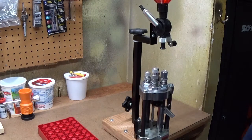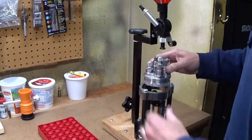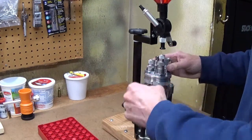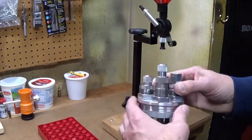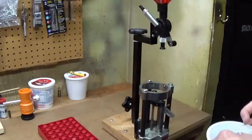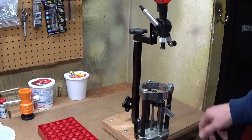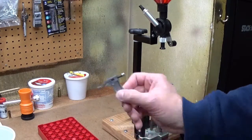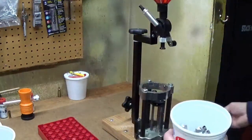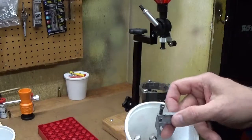I'm going to stop talking and show you what I do from scratch. I turn it all the way up, turn my turret slightly till the notches are lined up, and then the whole thing comes out. I store them in these little containers because when I went to go buy the real red containers from Lee, I couldn't find them and they were like ten bucks a piece plus shipping. So there's my small priming arm. For the .45 I've got everything right in here including the shell holder, so I put my large priming arm in and make sure it's got a little jiggle to it.